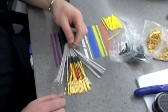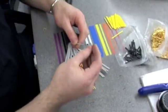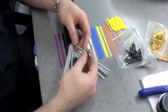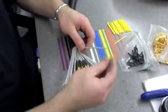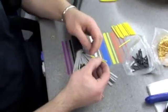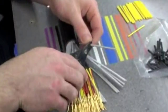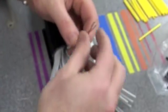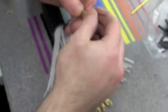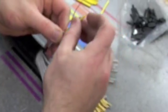What I do is take a channel like so — this is for when we strip the channel back, the outer jacket of each channel, just to protect that later. So you slide that over, take your drain wire and measure it, adding on about 5mm. You strip your channel where the bottom of your earth sleeve was, take it off, and you have three wires inside. You want to slide the earth sleeve over the earth, or drain wire as we call it in the industry.